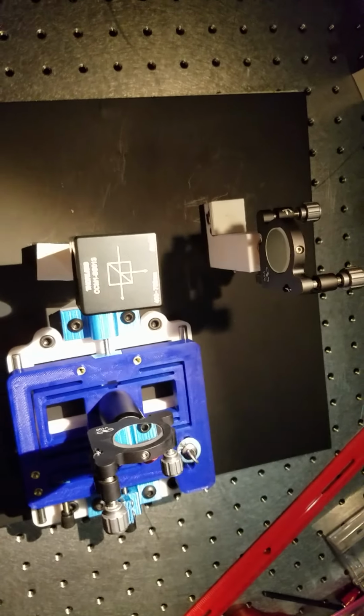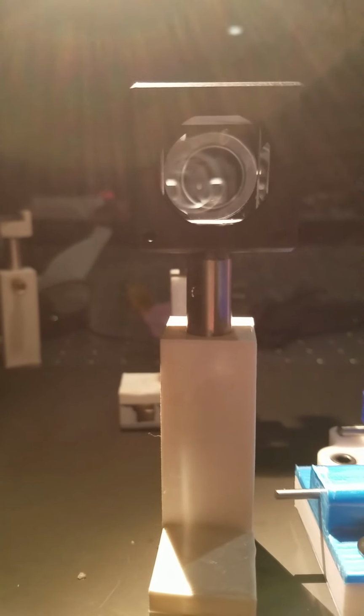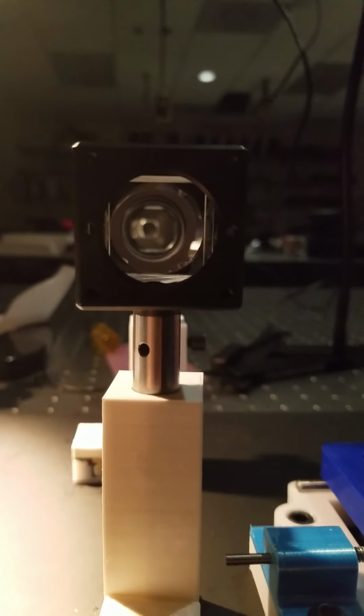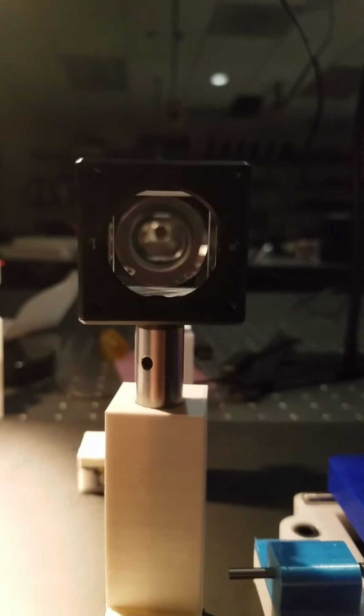Okay, and you should be able to look down the bore to see that if everything's kind of centered up, and you can see mine's off a little bit, so I'll correct that here in a second. Okay, now you can see that the bore is kind of straight on both paths for both mirrors. And for this part of the experiment, basically I have the styrofoam just down on the table because we're just doing rough alignment.